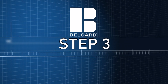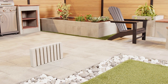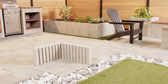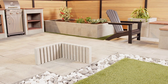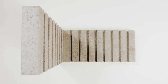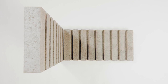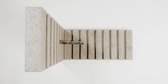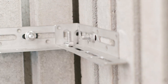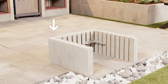Step 3: Once your brackets are assembled, it's time to place your first large panel. Place your second panel next to it at a 90-degree angle. Use your carpenter square so that your angle is just right. Now it's time to make a corner connection. Slide your pre-assembled corner bracket into place and use your drill to secure your hardware. When attaching the next panel, offset and make another corner as shown.